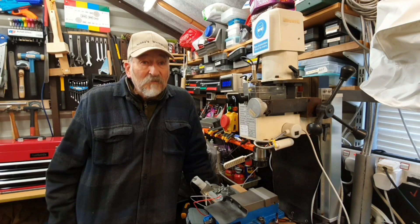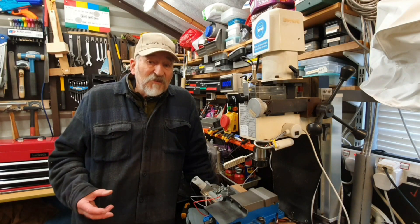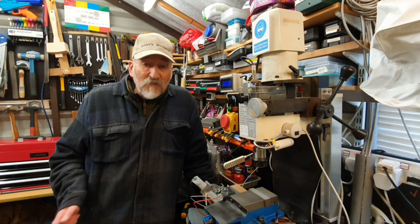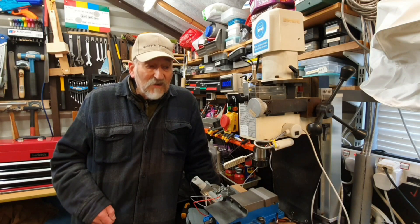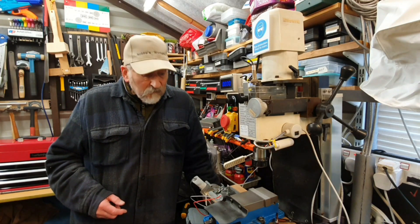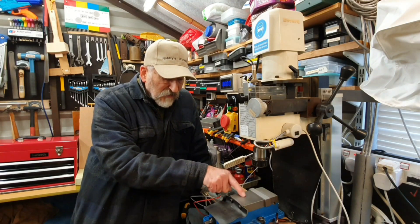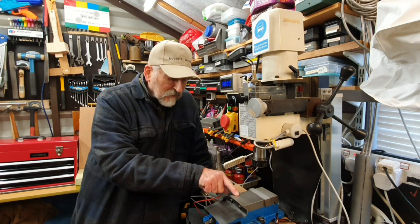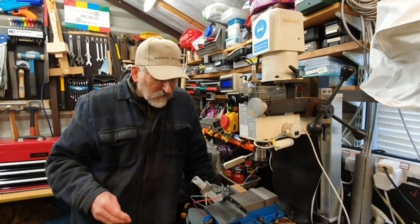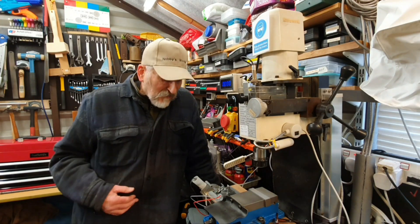It's very cold in the workshop today — about 10 degrees. I keep a sensor in the house which gives temperatures in a couple of parts of the house, and one of the sensors I keep in the workshop so I can monitor the temperatures out here. I did find when I came in this morning — it's a Sunday morning — the top of my mill vice, although it was covered up, did have some flash rusting on the moving jaw main part, fortunately not on the actual jaws themselves. So I've already given that a bit of a clean up and I'm going to make sure that's covered in some nice thick oil before I go out.